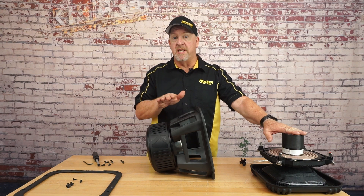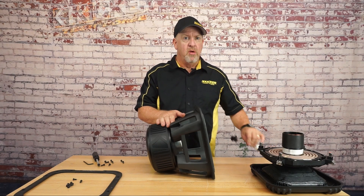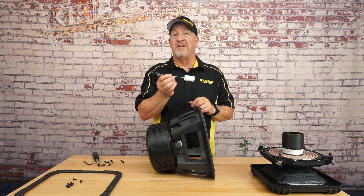When you order your cone replacement assembly, make sure its impedance matches the impedance of the basket — they are not interchangeable. It will also come with these eight alignment pins, which are very important to help make sure the voice coil is centered within the gap.